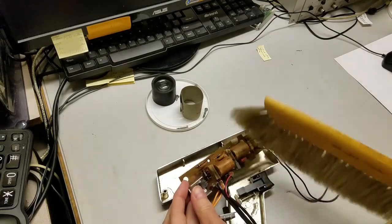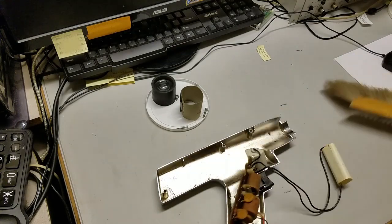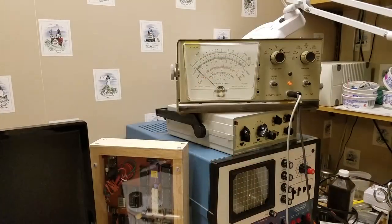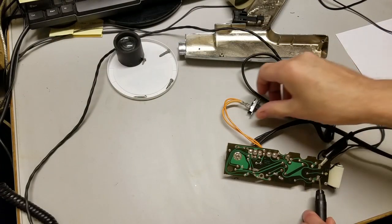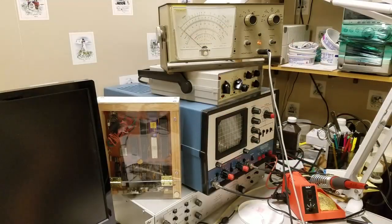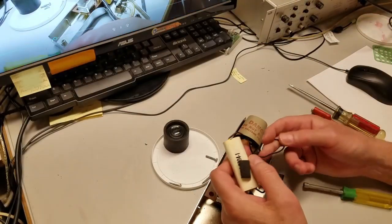The first thing I do is clean the printed circuit board. Early DC-to-DC converters are especially susceptible to dirt and contamination because that interferes with starting the oscillator — no oscillator, no power. Next, I connect my VTVM across the power capacitor; this meter is capable of measuring 1,500 volts DC. I attach the power, pull the trigger, and — whoa! I didn't expect that! The tube fires and this does have signs of life. I try again and measure the voltage across the capacitor at 500 volts DC. I think I'm going to put this back together and see if it will work on my car.